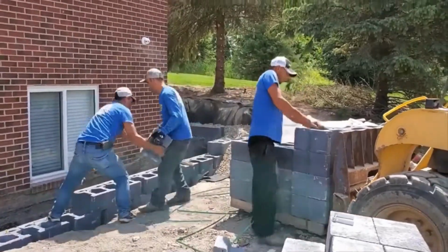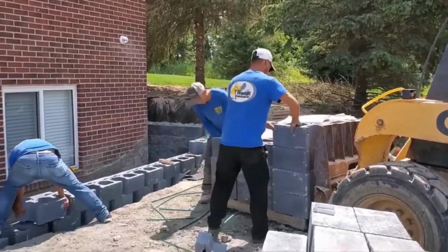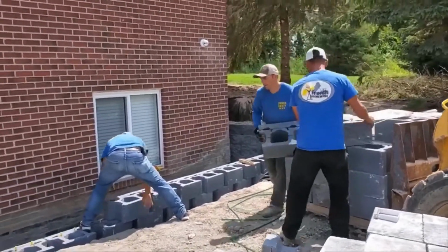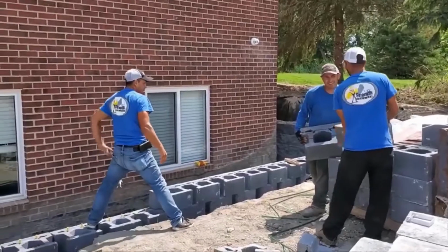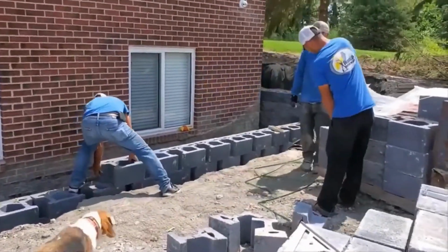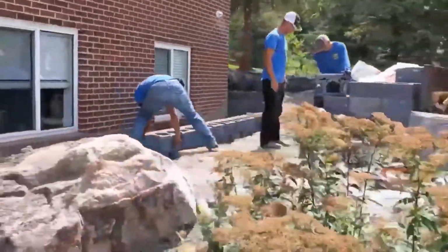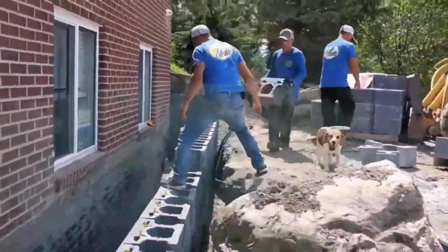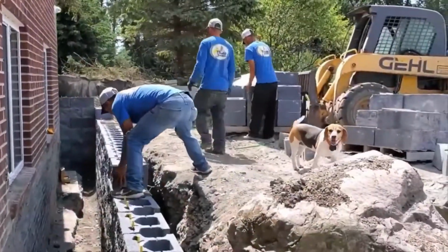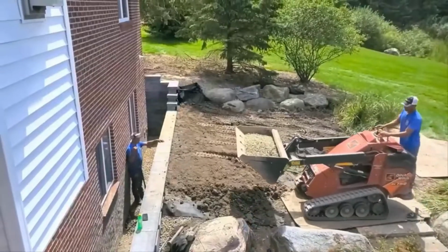What we're doing is taking all that stress off this home and building this retaining wall. This is the retaining wall material that Scott and I endorse and love the most. It's Keystone. Here in Michigan, Fendt is the distributor. It's 86 pounds a block, and then you fiberglass pin it together. Here in the north, if there's some movement, it's fine.